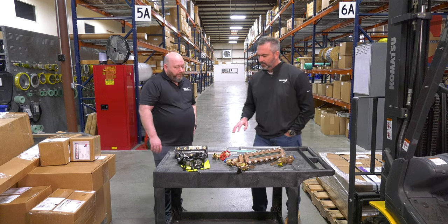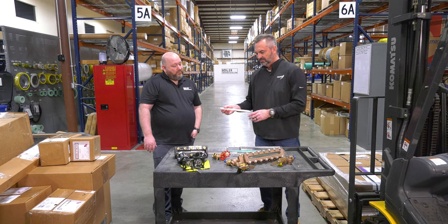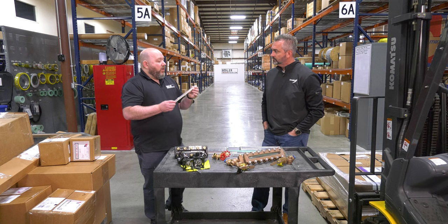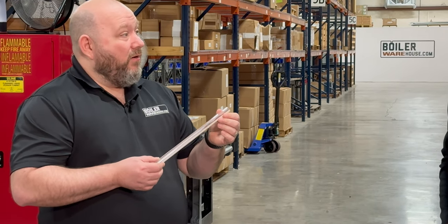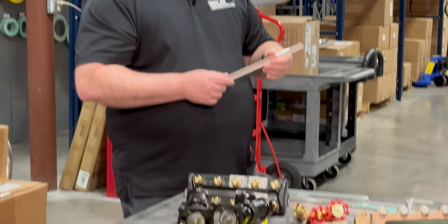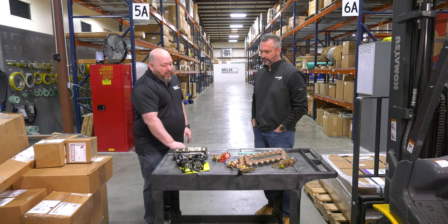As far as whether you can over-spec by putting heavy-duty armored sets on a standard boiler — yes, and we often recommend going to a heavy-duty set when customers complain about the standard glass. Sometimes there's a lot of vibration in the boiler room and the standard glass wears out quicker, customers get tired of tightening them down, steam etches and cracks them. The heavy-duty set is kind of set-it-and-forget-it — you're not having to touch it every month or dealing with drips on the floor constantly.